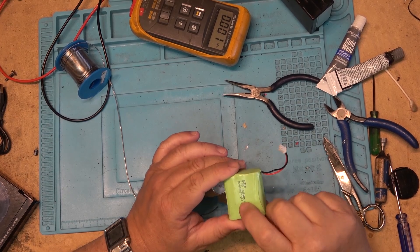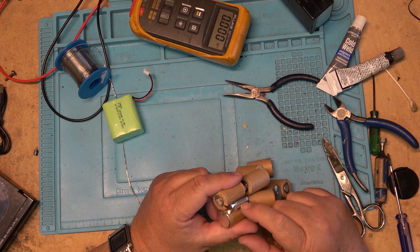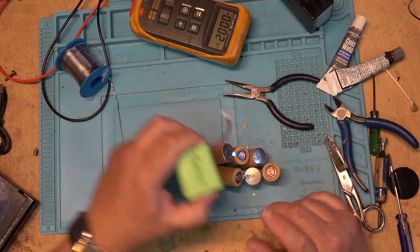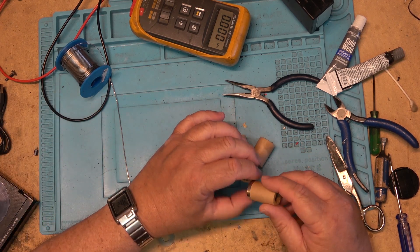Let's let the battery charge and see whether it will power up the camera. There is a temperature cutout on the pack that I put in, just like the originals had a temperature cutout, so that if they were to overheat it will stop the charging. The new pack I put in — the first one that's sealed — has one of these on it already, so I haven't defeated any of the circuit protection.